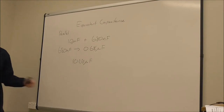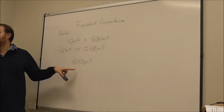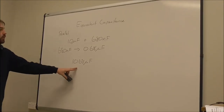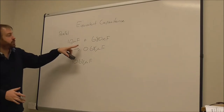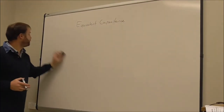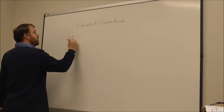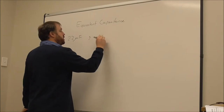So make sure you convert from one into the other. I could have done microfarads in nanofarads. I could have said 10,000 nanofarads plus 680 nanofarads, and I would have got 10,680 nanofarads as my answer. Both are correct because they are the same thing, really. They're just a different scale I've used. So they're pretty straightforward. All you need to do is remember to convert them to the same scale group. In series, you need to remember to do the same thing.